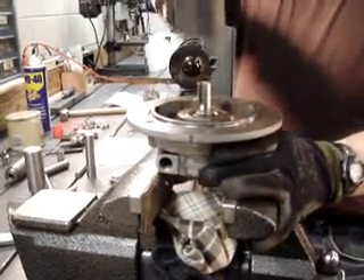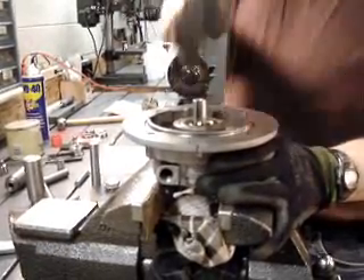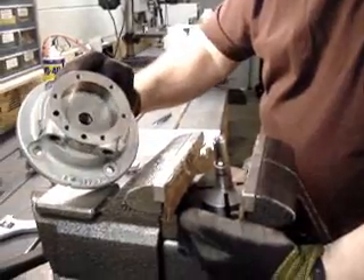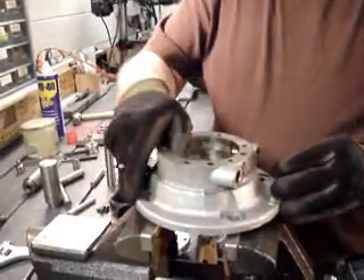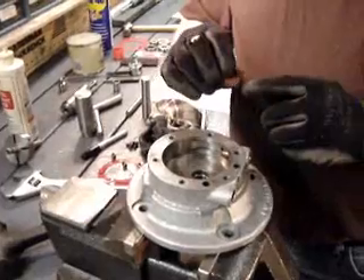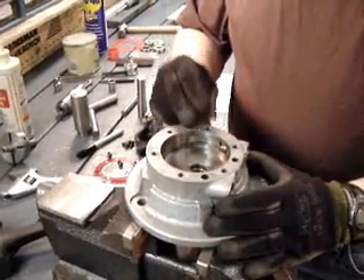Now I'm going to bang this out with a rubber mallet. When it's almost out, I'll get down here to catch it. Now the top side of the motor is empty and we have the rotor disassembled. This is the point where we can take the vanes out and begin to inspect the internal parts of the motor. In a lot of cases, if the motor is under-lubricated, the vanes are going to get dried out — they'll chip and crack. When that happens, 90% of the time the motor is going to end up seizing. That's why it's important to keep your motors lubricated.